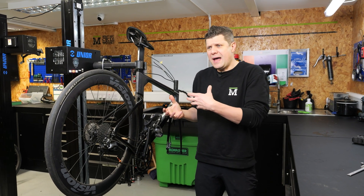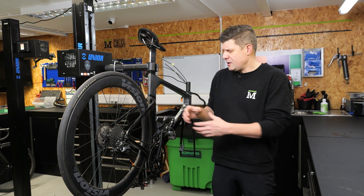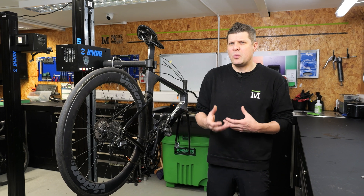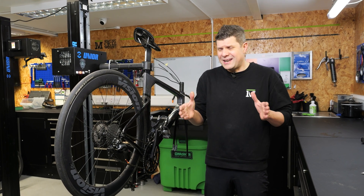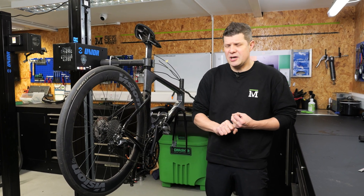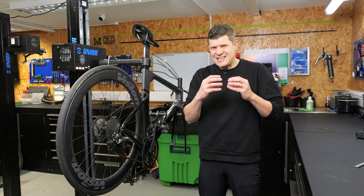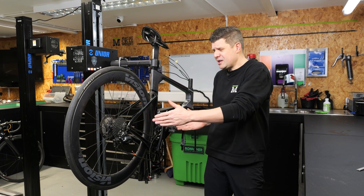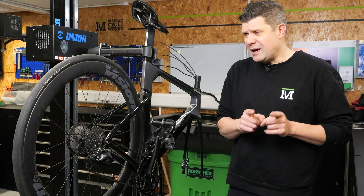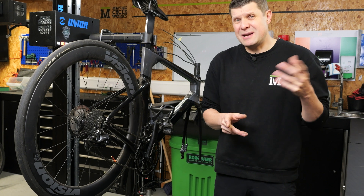So what can we learn from all this? Essentially, if you want a bike with very nimble, agile handling, you want to be looking for something with a relatively short wheelbase and short chainstays. Then you might need to look at the bottom bracket area to work out how much of a compromise you are willing to make — in terms of stiffness and strength. Generally speaking, if you go for a nice wide bottom bracket like BB386 Evo or T47 internal, you're going to find something that's good, strong and stiff. If they're trying to fit it all into a skinny little BSA or Italian bottom bracket, they've obviously sacrificed something to get the short chainstays — and it's normally going to be in stiffness. Take a closer look at your bikes; there's way more detail than necessarily meets the eye beyond all the marketing speak.